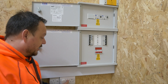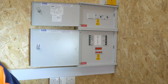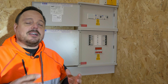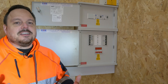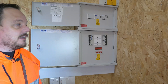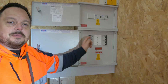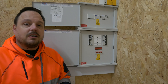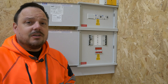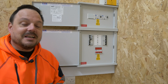I'm going to demonstrate locking off this circuit here. You'll see if I pop the little switch on just below — you can see the socket's in shot. I put a great big bright light firing straight back at me, so if I turn this off again you can see it's going to turn the lights off. The circuit involved with that particular light and plug top is this one, so if we switch that off there, we now know there's no electrical energy running to that light. Obviously that's not a safe way of verifying safe isolation; it's just an easy visual way to demonstrate on this video.